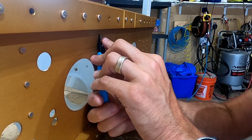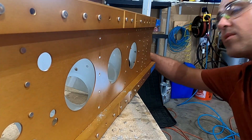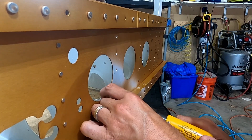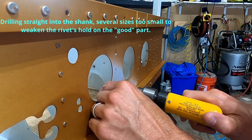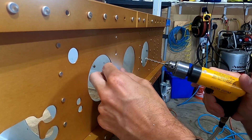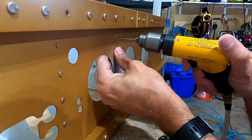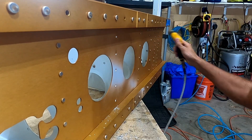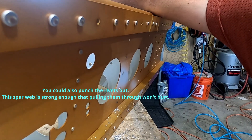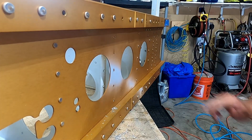This one's probably not going to be as good - yeah, it's all right. Come back with my smaller drill real quick here, make sure we loosen up a little bit more. This is the number 41 in an eighth inch hole, so I have very very low chance of doing any damage to the hole. What I'm doing here is just making sure that the shanks are no longer strong, so now I should be able to just sort of give this rib a little tug, and all of them are out.